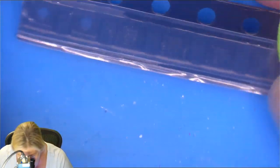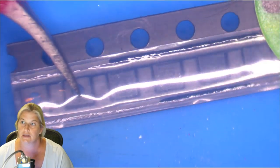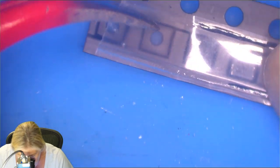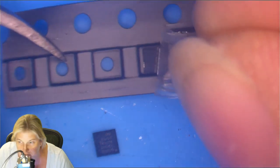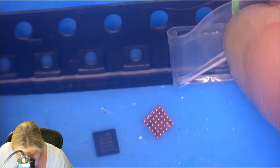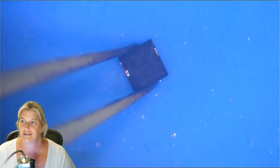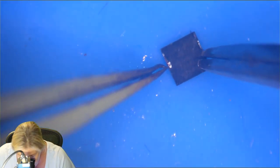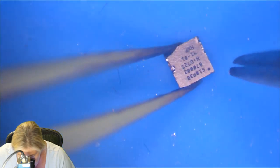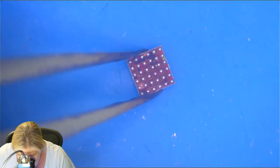Here's a strip of tristars — one of a batch of about 500. I put a sticker to remember them: these are the bad ones. I bought these brand new from a trusted supplier I've used many times. I open up what they believe is brand new tristars. So far so good — it looks new in the wrapper. But wait — look at the next one down. Look at this chip. Your chip when you first take it out of the package should not look like a toddler has been gnawing on it. It should not have dings, crunch marks from somebody's tweezers.